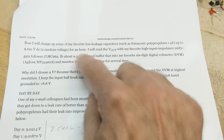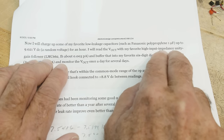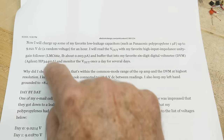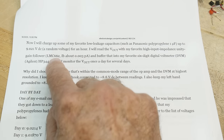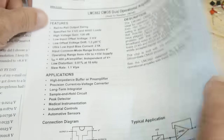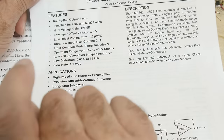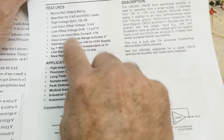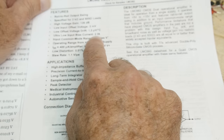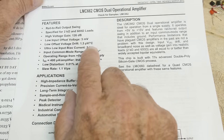He let them soak and then he reads the voltage out with his favorite high-input-impedance unity gain follower. You'd think it was one of those fancy electrometers — no, it's just a part, the LMC662. It's just a dual op-amp that looks like a generic dual op-amp, but look at this: low input bias current — that's the current that goes into the part, that's the thing you worry about — two femtoamps. Femtoamps.